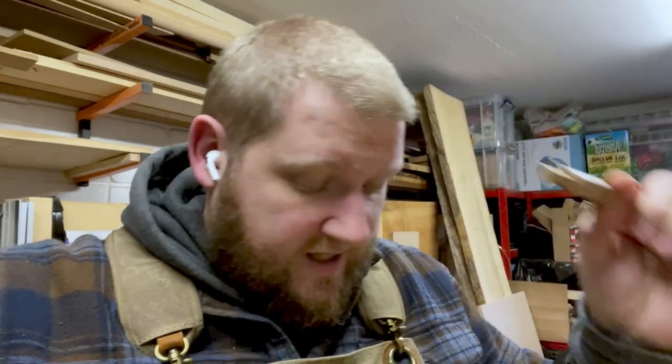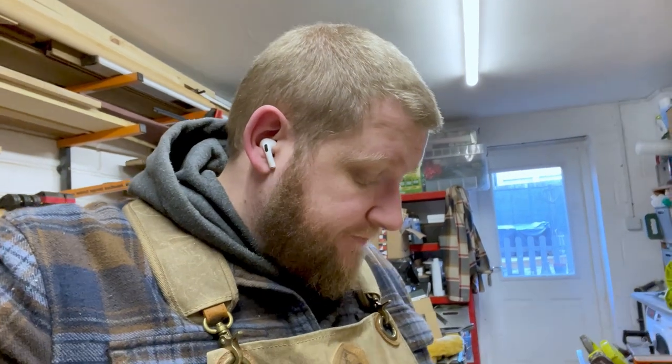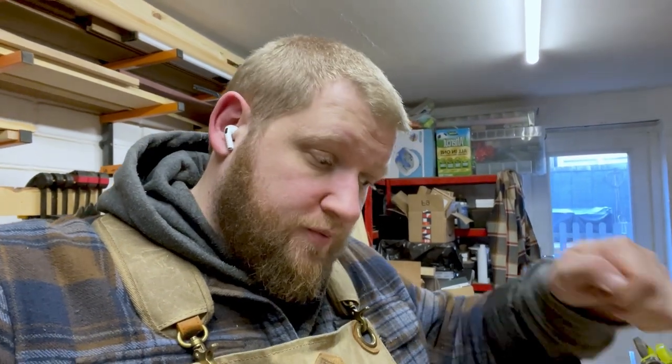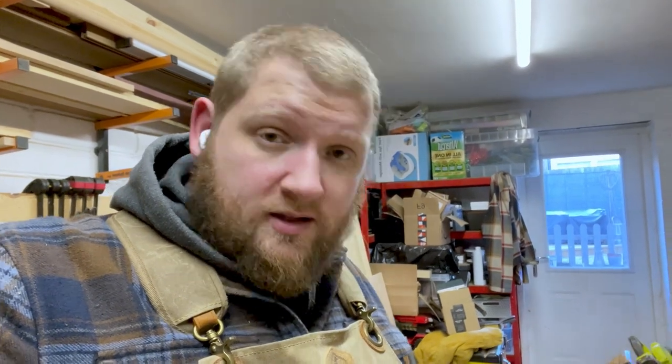So I now have my handles cut with the tenons. I have 51 — I don't know why 51, it's just the amount that I have. I now need to get the little dip in each side that makes it look oh so pretty. So I need to get the oscillating belt sander out and do a bit of sanding. This is going to kill my hands.